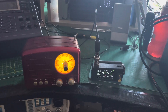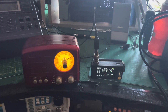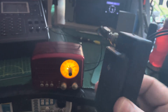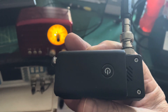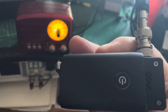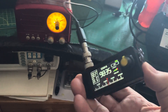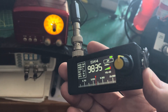I'm back again. This time I want to show you this little beauty — I've coupled a Bluetooth unit to it on the back. You can get these pretty cheap off Amazon or AliExpress, and this one can transmit or receive. I've got it set to transmit Bluetooth, and I made a little connector to go from the Bluetooth unit to the earphone output of the radio.